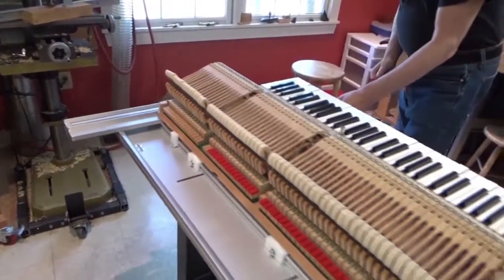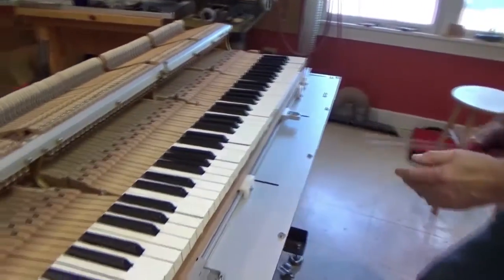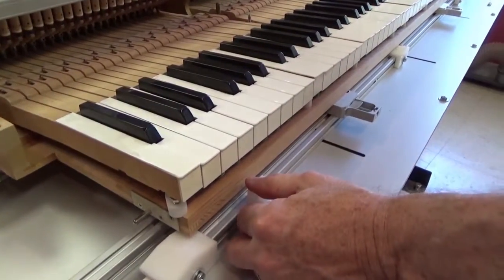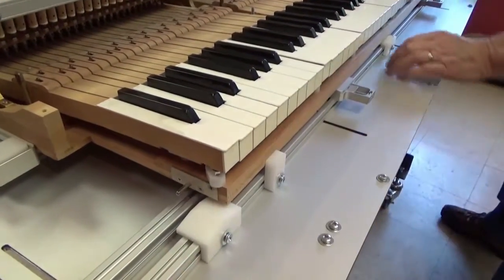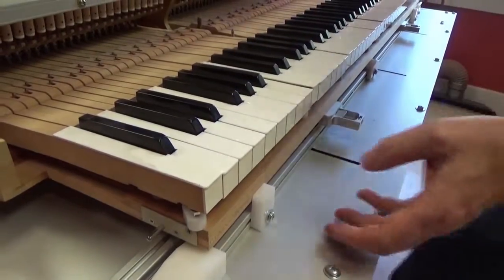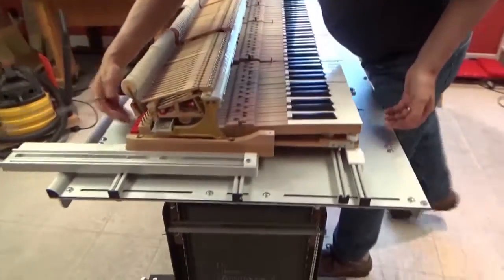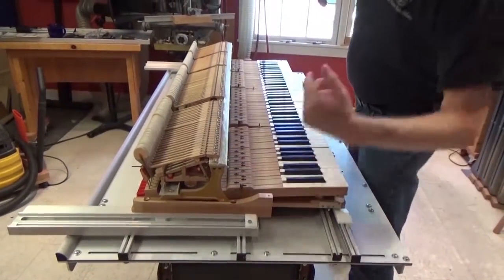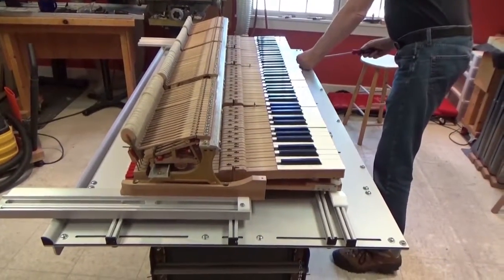Next step, I'm going to turn up the stops on the front rail and push the front rail into place. So now we have — just to make sure that it's true — the stop at the back is in contact, stops at the front are in contact, slipper tracks are in contact. We have a fixed position for the action.